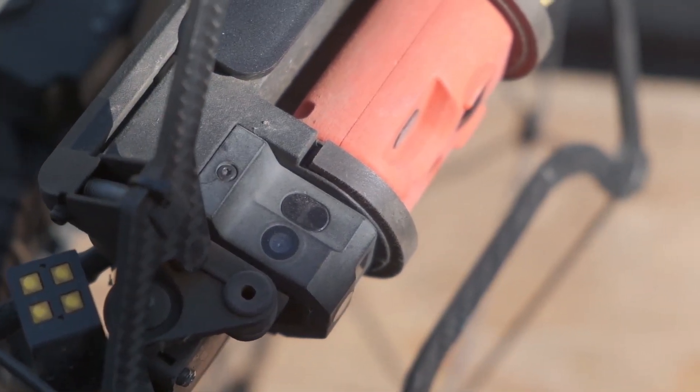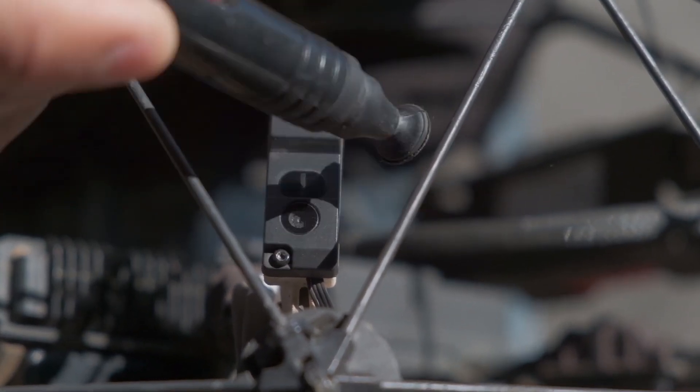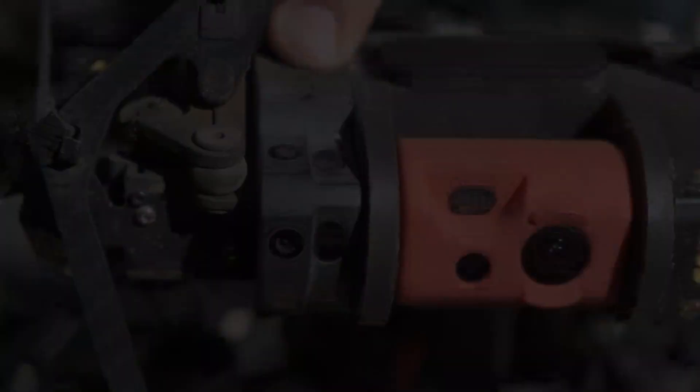We recommend you spend time using this mode in a controlled environment. In dusty environments, the sensors can get covered in a layer of dust in a single flight, which drastically reduces their effectiveness. Inspect them after every flight and clean them if necessary. Remember that the stabilization system works best near objects. Plan your flight to stay near high texture surfaces and be ready to manually switch to attitude flight mode when flying through dust or large open spaces.